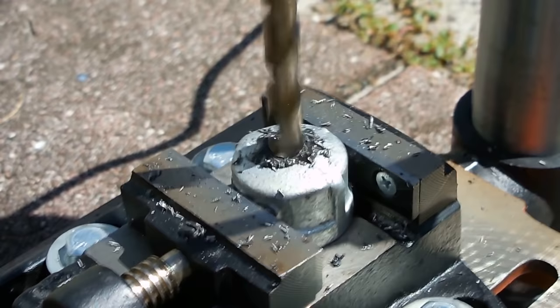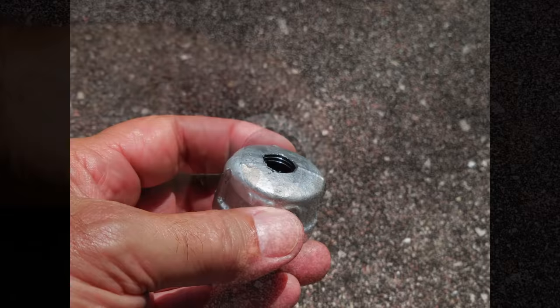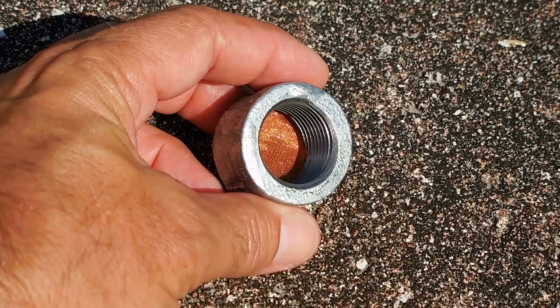As you can see, it's fairly easy to drill into these caps, now forming the threads using the quarter-inch pipe tap. Here's a look at the completed cap — you can see the male fitting of the hose is now threaded into the cap. Now taking a very fine mesh copper screen and placing it inside the cap; the purpose of that is to prevent any activated charcoal from finding its way into the line.